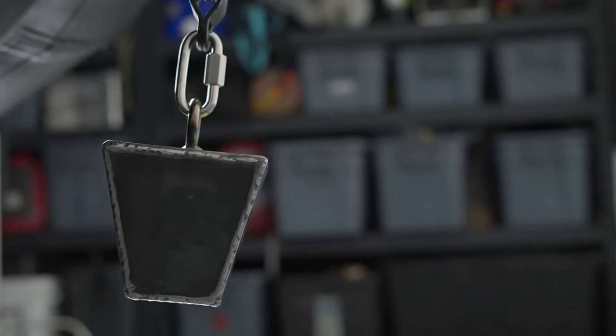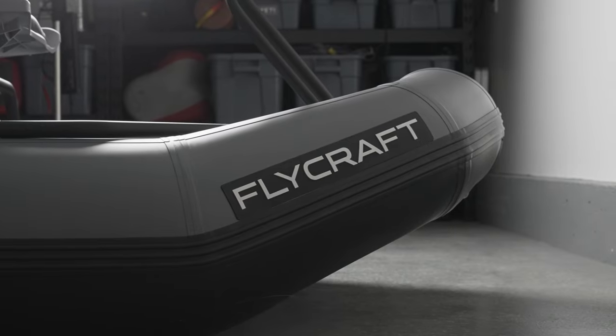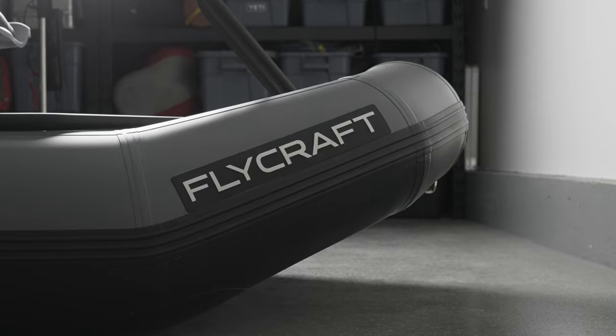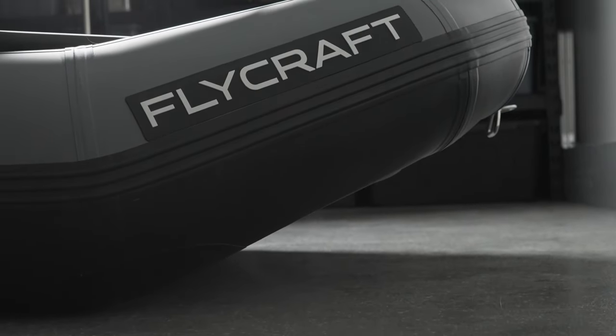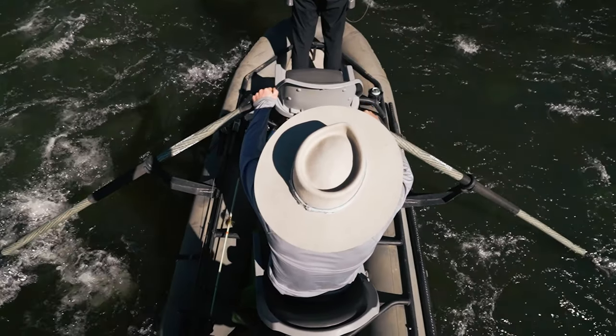Whether I'm in a small stream, a lake, or a really pushy fast-water river, a 25-pound anchor holds this boat. A lot of people are surprised — a lot of that has to do with the rocker, which is that lift in the bow and stern. Our boat has a lot more rocker than most fishing rafts, modeled after what you'll see in whitewater rafts. That rocker gives you a bunch of advantages: although we're a 14-foot boat, we don't have 14 feet in the water. Those extra feet front and back ride out of the water, giving the boat a lot of maneuverability through boulder gardens and rapids. Even a 12 or 13-foot boat with a flatter design is going to feel like a much longer boat than ours.